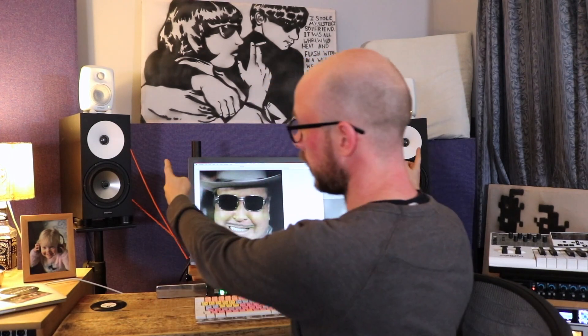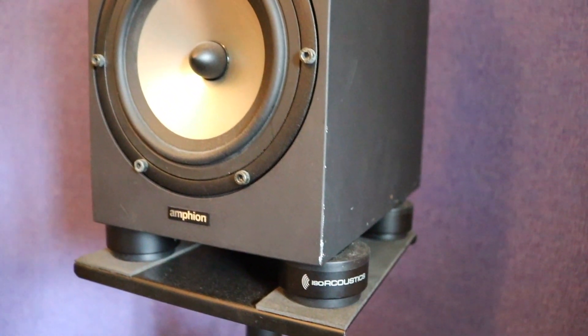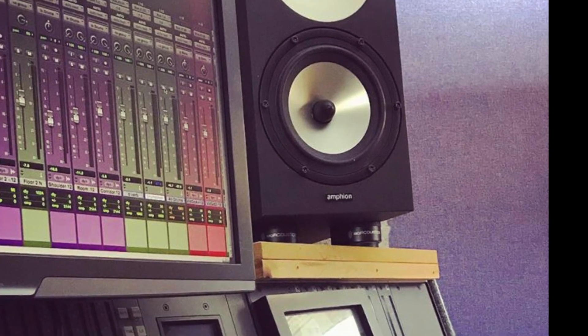I did the mirror points, and I've got what's called a cloud up above - just a single one of these frames with the Rockwool and material, hung from the ceiling right over the desk - covering all those mirror points and trying to absorb some bass frequencies in the corners. I've got my speakers set up how I like them, at the right height. The distance apart is worth thinking about - you see a lot of people with their speakers in kooky positions in corners. You want this equilateral triangle facing towards your head, and generally it sounds good to have that triangle going just past your head so they're firing just behind your head. I've also been using IsoAcoustics pucks under the speakers, which help to decouple the speakers from the stands.